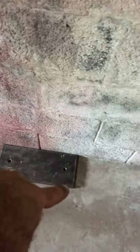Here's what we did: we come down here and set our base plates — just sitting there for now. Eventually we're going to be drilling and shielding through the slab. There are corresponding holes above, and they come very close to this wall — just sneaking by. We actually had to trim out that little section to get that column plumbed to the wall.